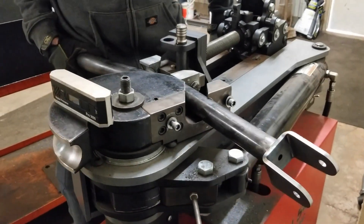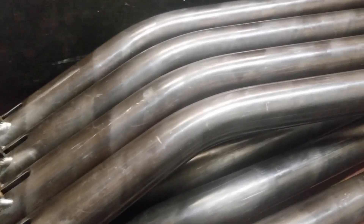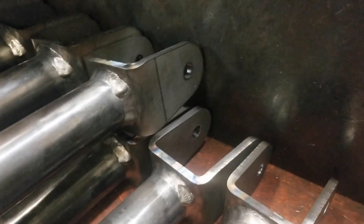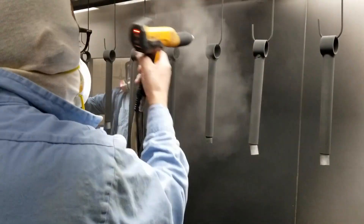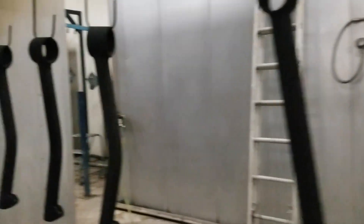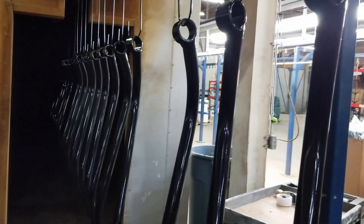Now we have completed parts built and inspected, but not yet coated. The parts are loaded into a large bin and sent across town to be powder coated. There, they go through a huge wash line to remove any remaining contaminants that could impact the quality of the finish. The parts continue down the line and are fully dried before the powder coating is applied. Past the paint booth, the parts enter an oven and are baked at 400 degrees, which cures the powder coat finish into a strong and attractive barrier from the elements.